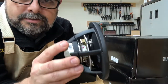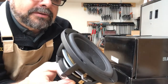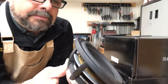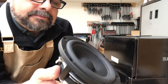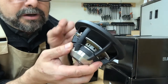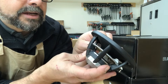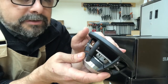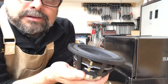These drivers are just gorgeous. Like other high-end drivers on the market, the finish is impeccable. They use all the right materials — this is a neodymium magnet so it has a lot of motor force. This is an overhung motor; you can see the voice coil there. If it were underhung, the windings would be down inside the magnet gap. I can see some copper in there too — there's a copper cap for good inductance control.